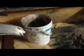And you can see the colour change that you get there in the sand. But with that being a brand new sand, in comparison to the old sand, you can see that the burnt off stuff is significantly a darker colour. That will happen over time. Some people will proclaim that you throw the sand out over an extended period of time. I've used this sand many times and it hasn't been any issue. I've just constantly topped it up with new sand mixed in with the old. The only thing you want to do over time, in my opinion, is make sure that you top it up with the other ingredients and make sure that there are no particular contaminants in the sand as you go on.